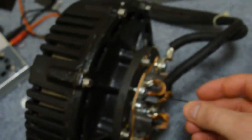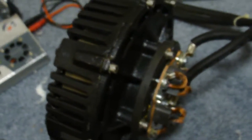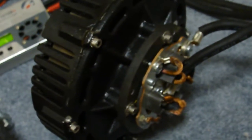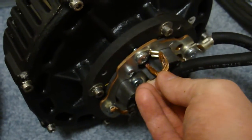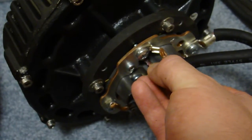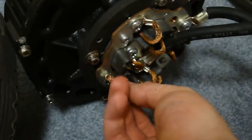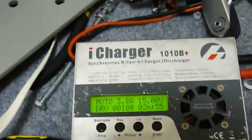This was just increasing tension, not really that much, on one brush — and you can have another 20 watts that's just friction heat on the brushes. So the spring tension on these brushes is really critical. You can hear the difference in the motor sound as you lift brushes off of it. You can actually lift a bunch of brushes off and it makes roughly no difference in the power the motor is drawing.